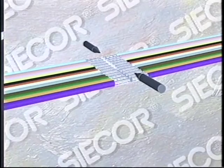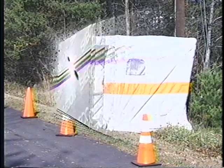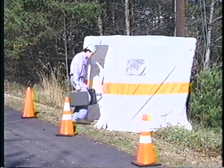The MiniMass is a fixed V-groove splicer and will yield an average splice loss around a tenth of a dB or better. Realize, mass splicing requires attention to cleanliness as well as quality fiber to achieve good results.